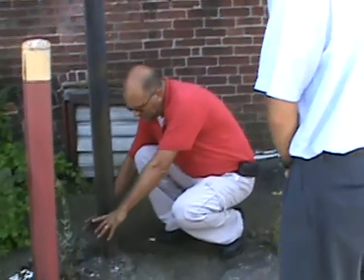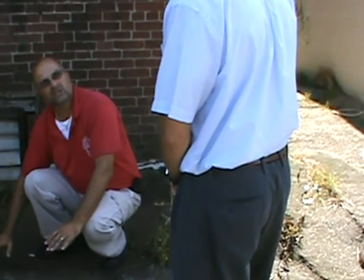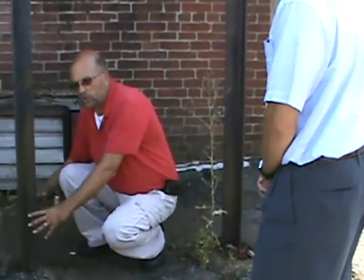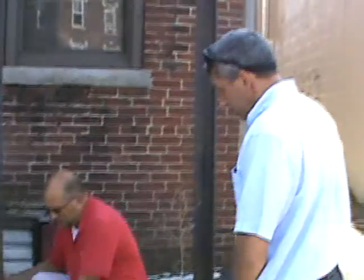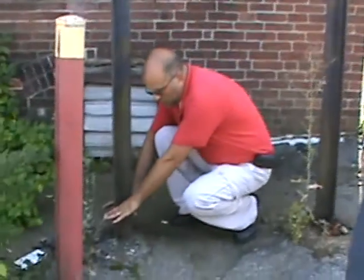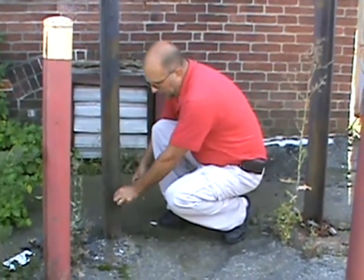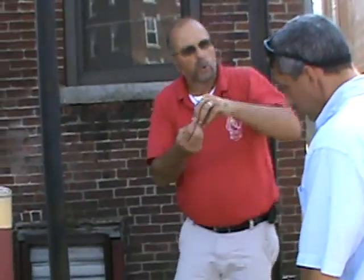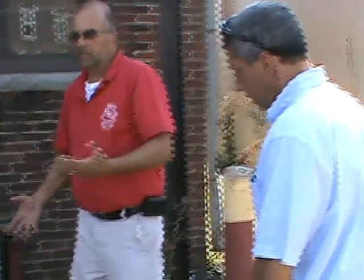Then I wrap it in cement, and then I fill it with about 6 inches, so that whenever there's snow, more than 6 inches of snow is what's going to be needed. But it's tarred 12 inches, so that whenever there's snow accumulating down here, it's sitting on top of tar. And then the last thing I put on this, there's a new piece of cement, Sonotube, I put in a clip that sits on top of the Sonotube, bolted here, so that as this rots, and this will rot, what's inside will rot away, the new clip on top is the new foot. What's wrong is sitting inside, but I can't do anything about it because they already built it wrong. But there's things you can do with that.